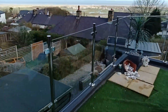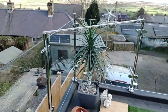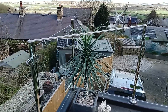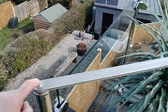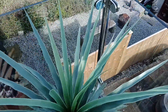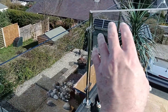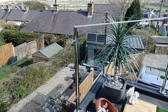At the bottom I made a shim to bring it off the rubber membrane - you don't want to be going into the rubber membrane. The shim takes an 80 mil long stainless coach bolt into the stainless shim, and that has strengthened it all up. We've had a good storm now and the glass doesn't move. I've put it in the corners, corner to corner. In engineering, if you can make a triangle that's the strongest thing you can make - and I've bolted through the top straight through.